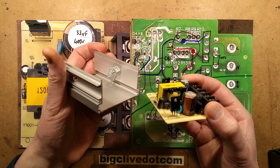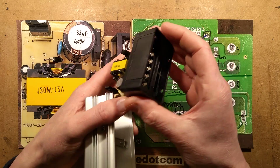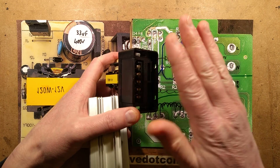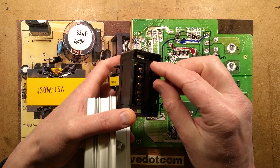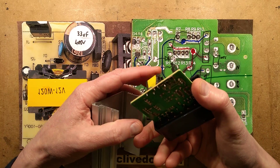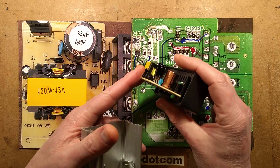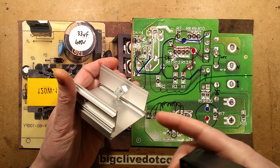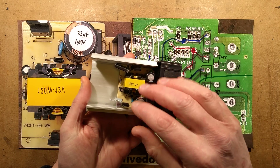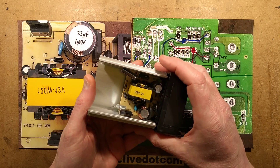The case is interesting in the sense that the circuit board is held in place and stopped from dropping out. It would be nice if the plastic end section had been made longer, with some clamps to hold cables and perforations to allow airflow for cooling and moisture to escape. It won't ever stop bugs getting in, and if bugs walk over the high-voltage part of the circuit, it could cause the power supply to mis-trigger and blow up. The separation from the ungrounded case isn't fantastic — there is an earth terminal, but it's not grounded. A drop of water could easily bridge from the live metalwork onto the aluminum. There are about two to three millimeters of clearance, so they have at least made some effort.